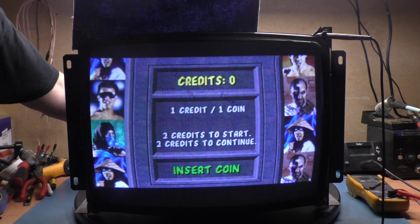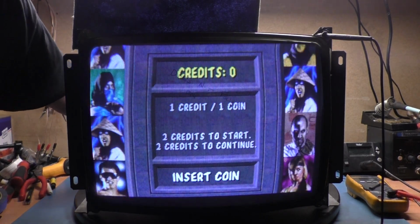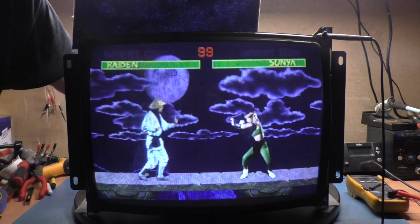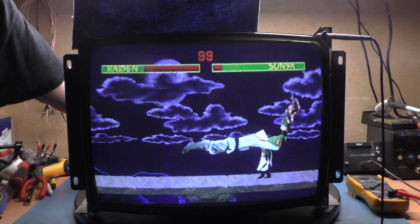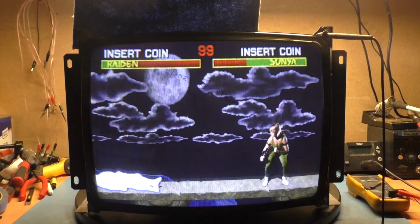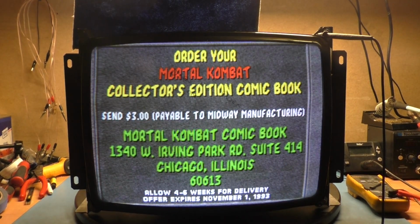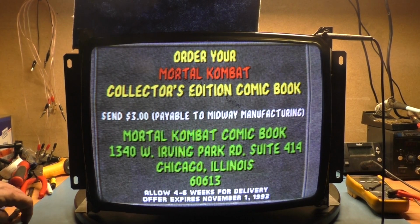Vertical size should be this one. Yep. Okay. We need to go down a bit on our vertical position. Okay, there we go. Let's go back to vertical height. And there we go. Well, look at that. All the color pots are pretty much centered, so it doesn't look like we really need to even adjust colors.